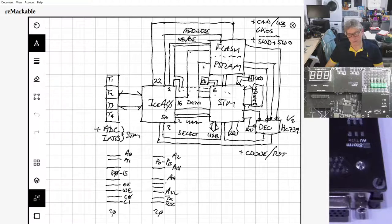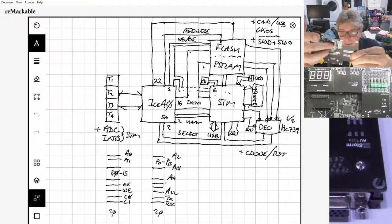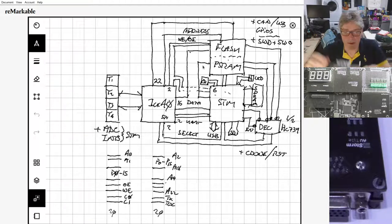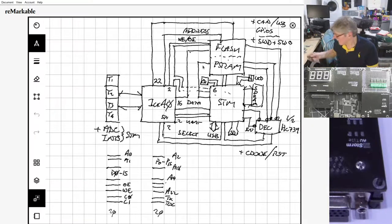And then if you wanted to operate in a non-retro situation where you wanted to use the HyperRAM, this would have a HyperRAM overlay, and then you could potentially use this as a tile. However, the more you look into how you do that with the particular lines, the deeper it gets and the more difficult it gets to resolve. In particular, the HyperRAM, we've chosen very specific pins.